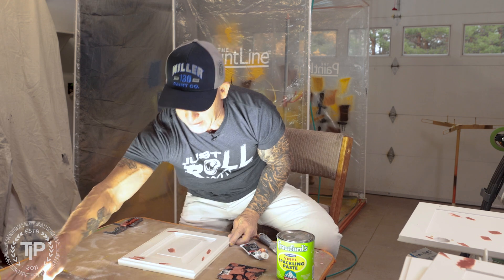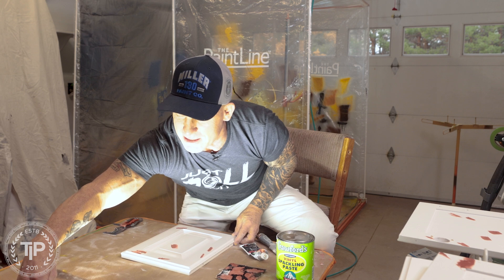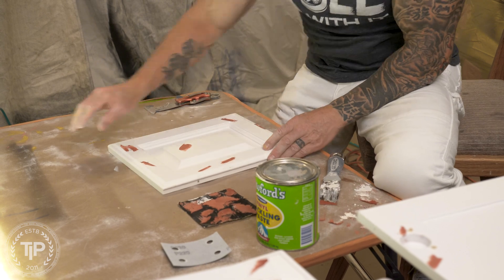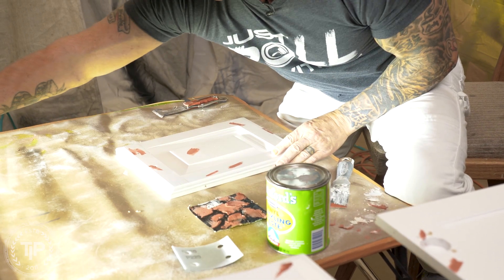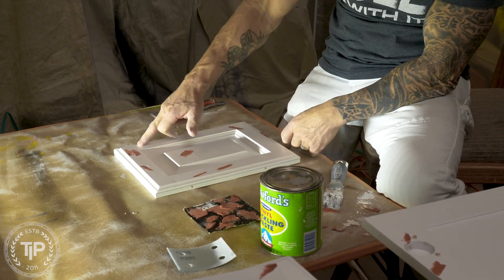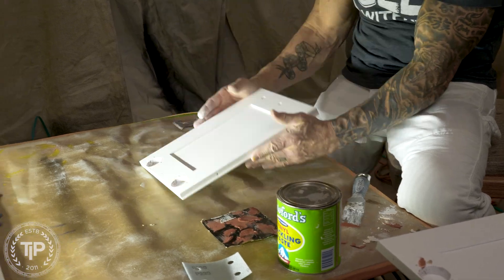Now the benefit of an inspection light — without it, if I cast this thing up, that's at me, so we'll just cast it down. Now I've got the table right here. This finish actually looks pretty amazing — that thing looks finished. But when we cast the light from an inspection light right across this door, now I can see all kinds of imperfections: a seam here, things we've already filled, surface tension. The finish isn't very flat. I can flip my door over and see knot holes — all kinds of things that this light reveals.